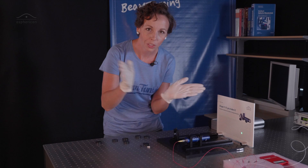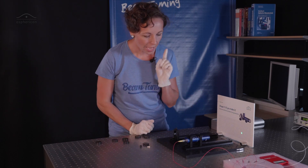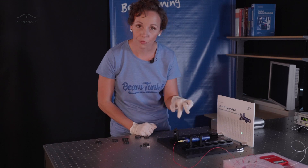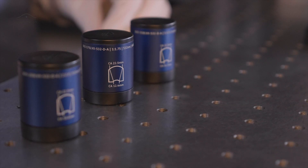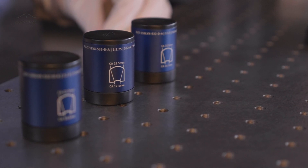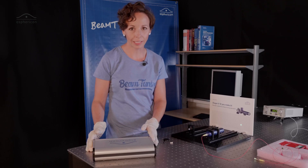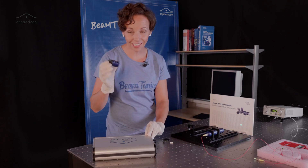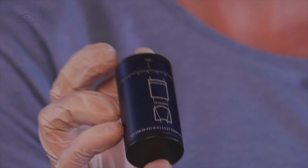So you can use it to increase or to decrease your beam. Important: the biggest magnification should always be in the first position in your setup. All the beam expanders are available for five different design wavelengths. But if you want to use a wavelength in between, don't worry — we have this little guy here called the WaveAdapt, and I will explain how that one works next time.